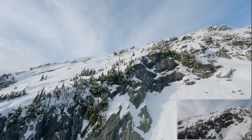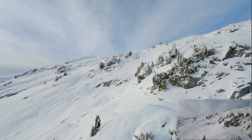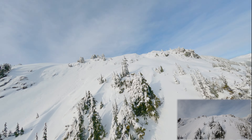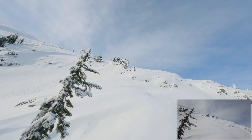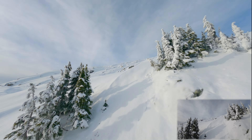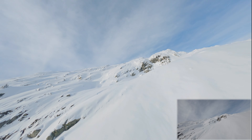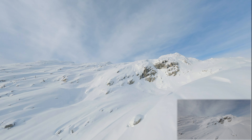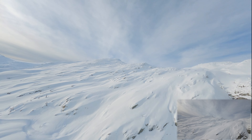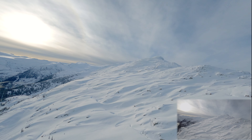I think it must have something to do with the 1500kV motors, but I also think I have this one tuned particularly nicely — it just feels so nice to fly. With this LiPo on here it really kind of sets it free a little bit more compared to the lithium-ion packs. These large 3008 motors at 1500kV spinning 7.5 inch props will sag out the lithium-ion packs fairly quickly when you pop the throttle up.